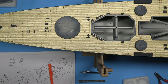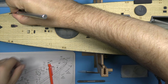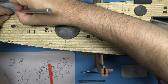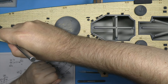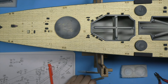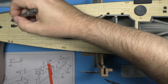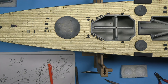Let's get these little tabs off where we're going to put our large bollards. Even though the deck is perfectly aligned where it needs to be, the holes aren't — and that gives me all sorts of problems, especially when the holes are offset because a drill will always follow the hole. The holes are more offset on this side than on that side. I'm just going to change my drill bit and open those up a little bit. Even my reamer will follow the hole — let's try the reamer first.